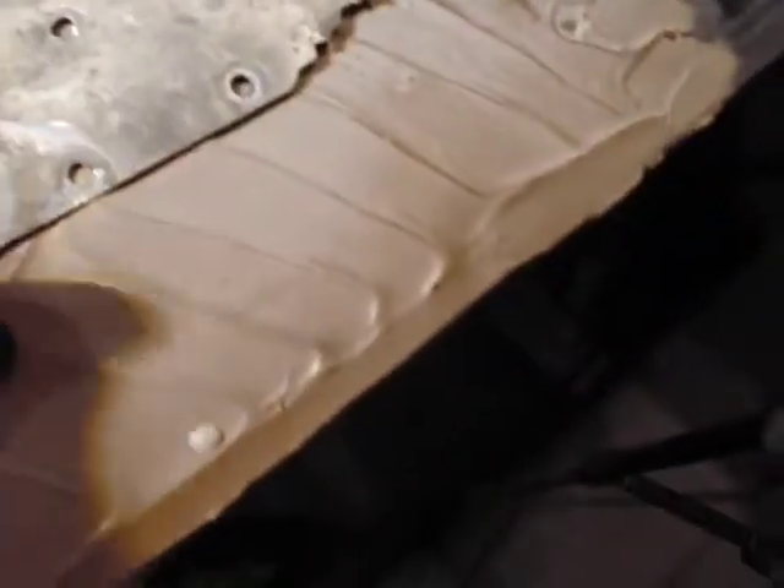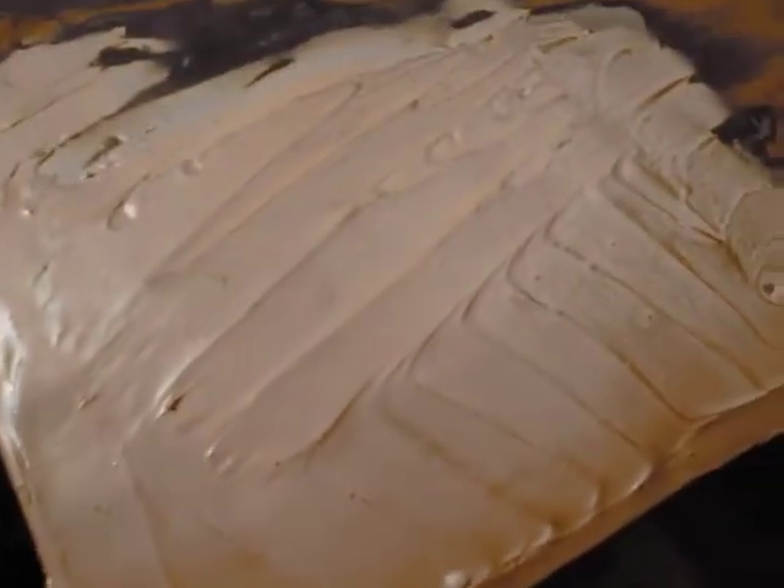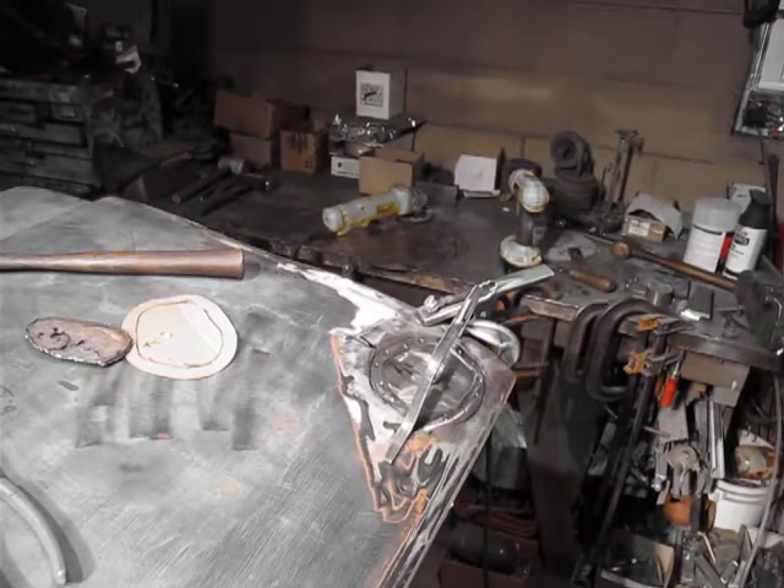The genius that repaired this before me put a lot of extra holes, so I had to weld those up. Some just spider-webbed — spider webbing is when the metal just goes away when you weld it. I can't show you right now because it's all underneath the bondo. There was a little rusty edge I just couldn't weld on, but I did get new metal in there. Without further ado, we are going to weld this right now.